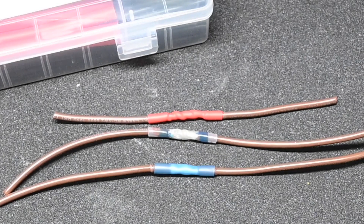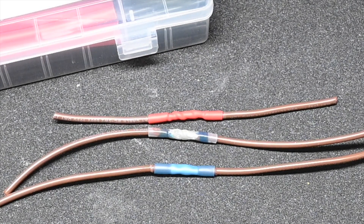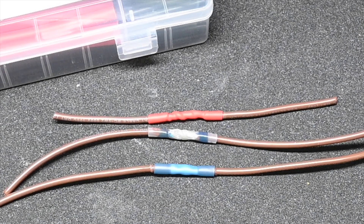In this video I will demonstrate my three favorite methods of making a wire splice in an outdoor environment. This includes wiring under the chassis of an RV, perhaps for trailer lighting or brake wiring. In these areas a waterproof splice is essential as any wire exposed to the elements is susceptible to damage. I have seen water wick up a stranded wire for two to three feet just from capillary action, eventually oxidizing the wire.